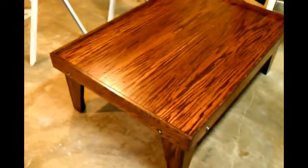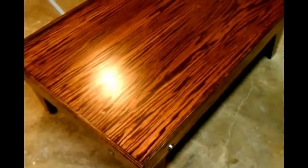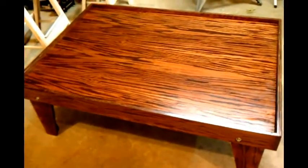Here's our finished train table. The board is 35 by 50 inches, so adding the frame it's actually 35 and three-quarters by 50 and three-quarters. You can see the edges, the bolts, and the legs — fine craftsmanship. The board was 40 bucks plus some supplies and polyurethane. I used oak board and stained it red mahogany, then four coats of polyurethane on top with a non-shiny finish. I kind of almost wish I did shiny because it's kind of shiny anyway — but the gloss would have shown imperfections.